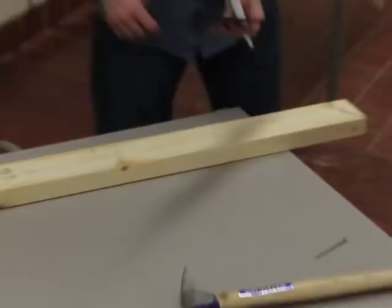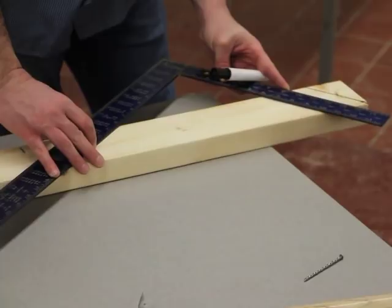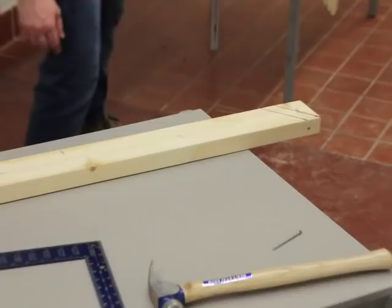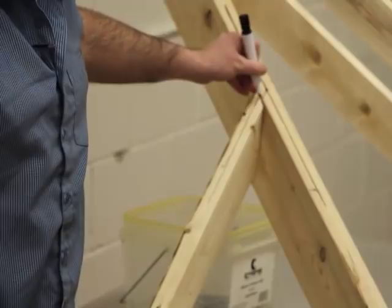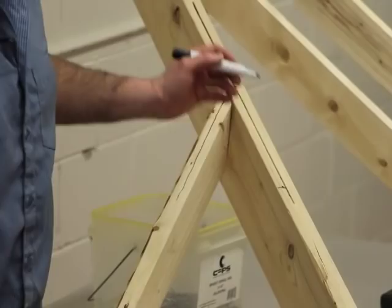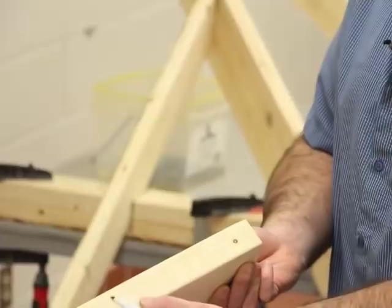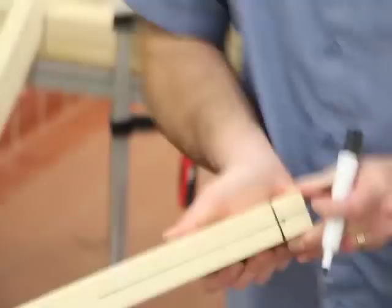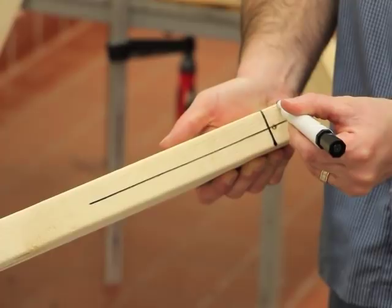That little dot right there is the shortening for the top of the jack. As you can see, the jacks have a bevel cut on them. Although I've accommodated this inch-and-a-sixteenth shortening from here to here, I still have to create this bevel on the top of the jack. I'm going to do that by cutting either above or below the line by half of my jack stock thickness. If we draw a center line up here and square a line across the top of the jack, it gives a better idea — coming three quarters of an inch above this line.